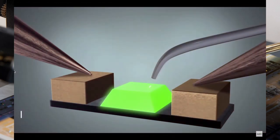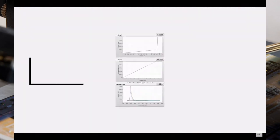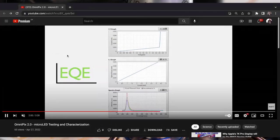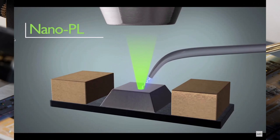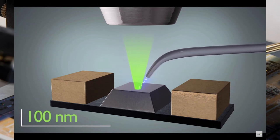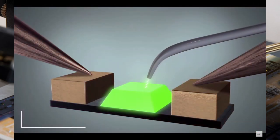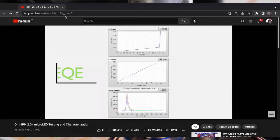What are those two golden blocks next to the pixel in the video? Every team designs it a little differently, but essentially the chips on the wafer have electrical contacts shown right next to the chip. Sometimes you'll see a common ground. People are very interested in seeing the electrical excitation of these chips because in a phone that's how they'll be excited — photoluminescence excites optically and the chip emits light, or electroluminescence excites electrically and it emits optically.